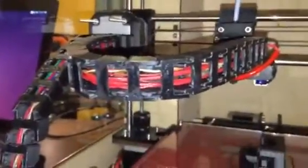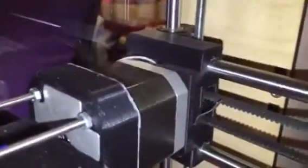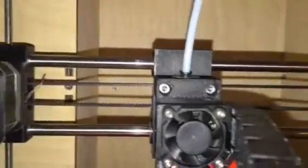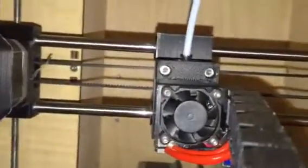I wanted to do cable management really well, so I went ahead and put in some cable chain for the X-axis, the Z-axis, and also for the Y-axis underneath the table, which controls my heated bed. The micro switch for my X-axis is embedded and mounted inside one of the Z-carriages so that you don't have it sticking out in the open. You can see on the back side how that belt goes into the clamp. It clamps both ends of the belt, so you don't have to use zip ties to create loops on the ends or another zip tie to draw the ends together.